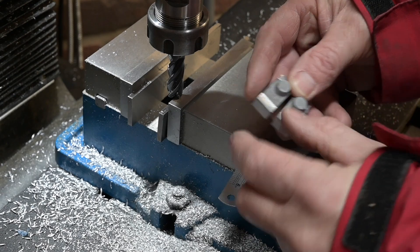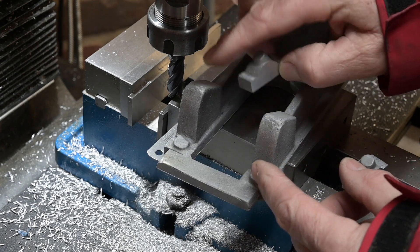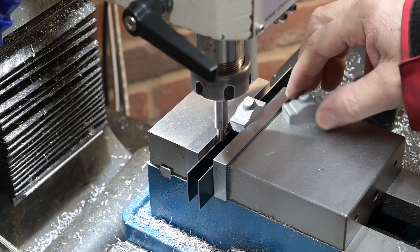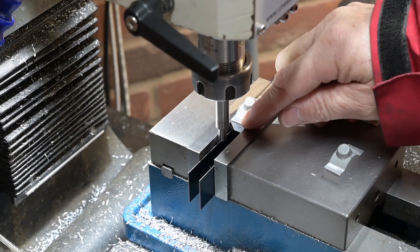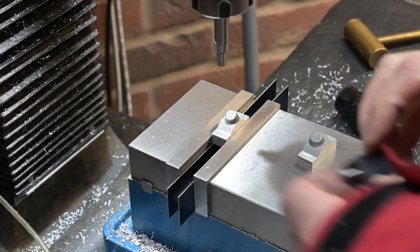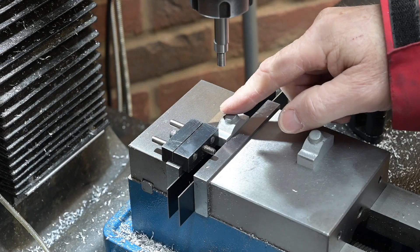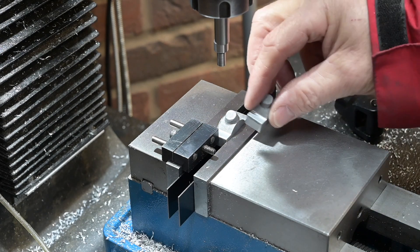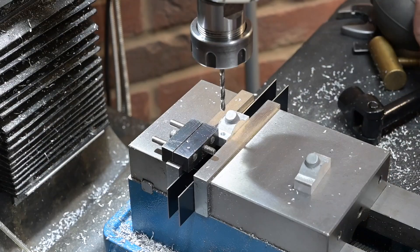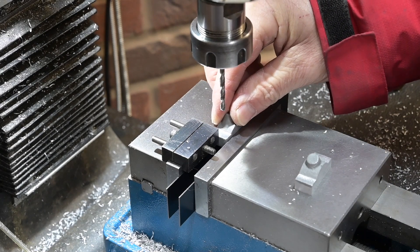Just got the holes to drill in here and then they'll be ready to mount onto the base once I get these surfaces machined off. What I'm going to do is indicate off of the back jaw and off of this face so I can set up for the bolt holes. I've got that position now, so I'm going to put a stop on it — got the table locked down on the X and Y dimensions, so now all I've got to do is just slide them in and drill the holes. Because it's already set up, all I've got to do is just flip it round, slide it up to the stop and away we go.